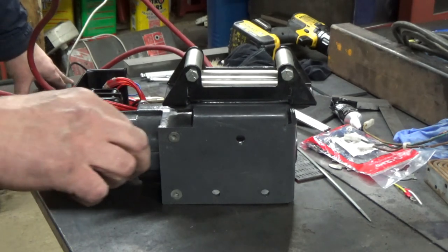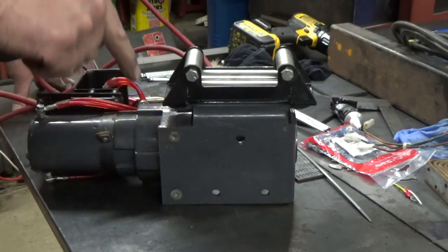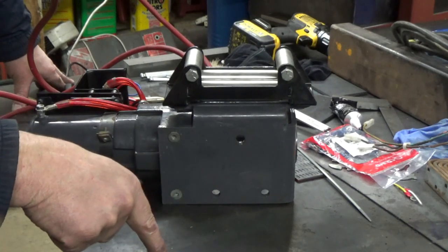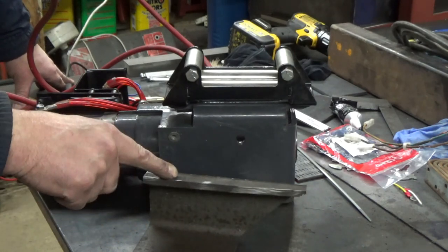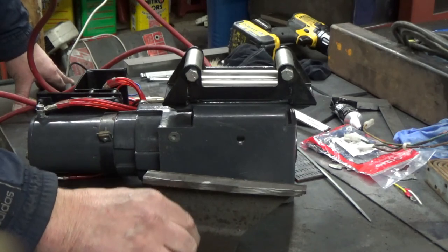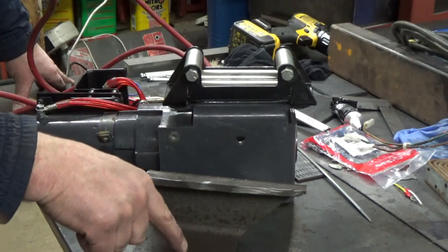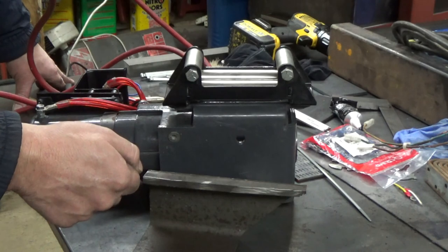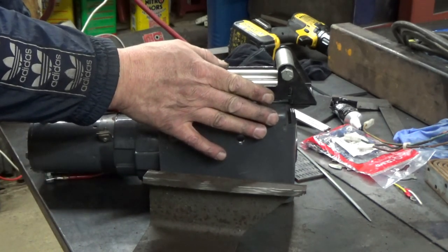which have got the stem bolt taken out of them and a hollow down the centre, but a cap bolt going into each one. So to use each one, I would take out the bolt that's in this, probably take out the cover bolt out of the floor, put the winch over the hole, drop down the pulling bolt, tighten it into the floor, then this will be anchored to the floor somewhere.